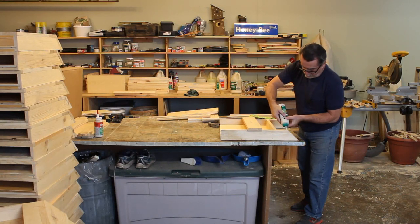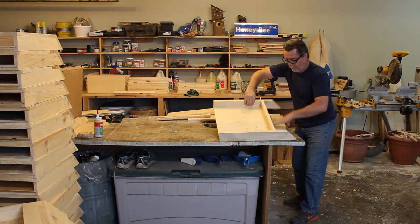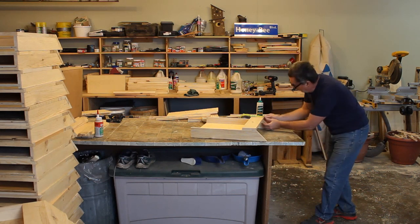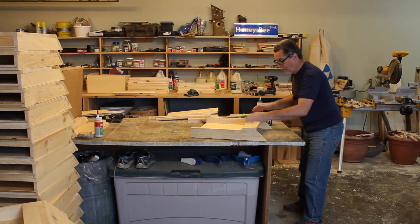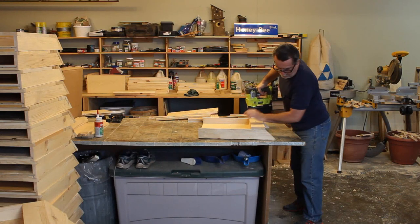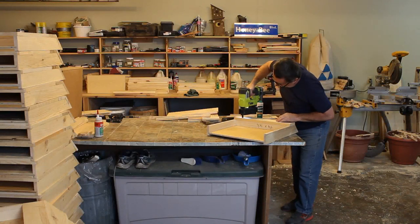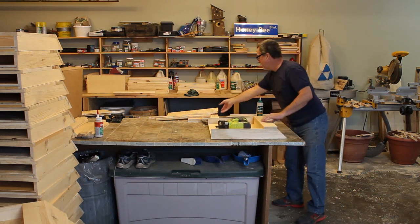I lay a bead of glue just on the first three or four inches, then a bead of glue across the front piece and along the sides. I carefully put this piece on, not worried about the back end — I'm just trying to line up the very front edge of this board flush with the top. I hold it gently since the glue makes things want to slide. I throw a couple nails on each side, checking that it doesn't walk, then put two or three nails into the top board trying to get the nail into the center.